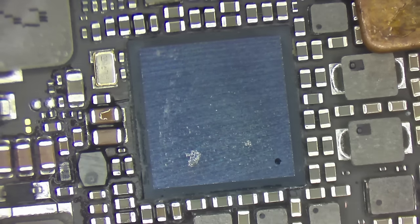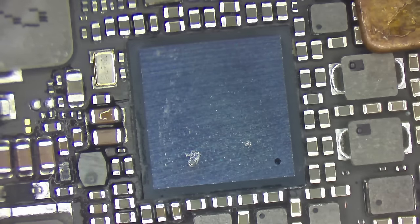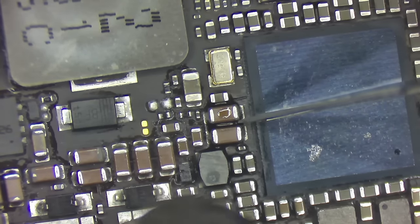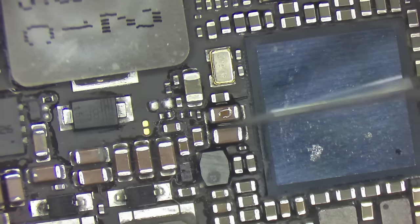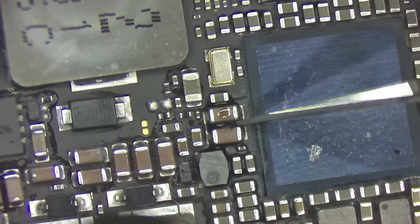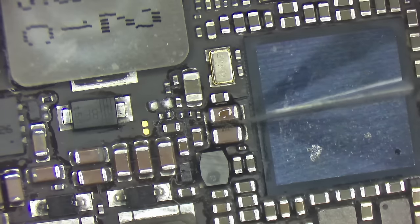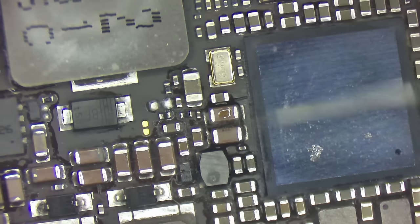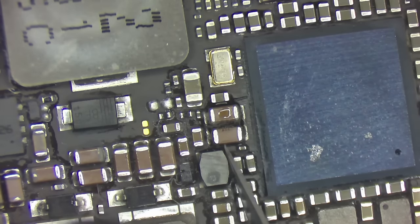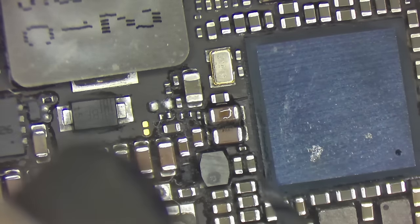So now that I've put on just a little bit of protection, I'm going to continue to warm this up. And man, everywhere I see that we've got glue stuck between stuff, I get worried. Well, I don't like seeing my razor blades bent a little bit. I'll put a new blade on here when I'm ready. I get worried about balls popping out. It's not near as big of an issue as it used to be, and that just comes from better control of hot air.